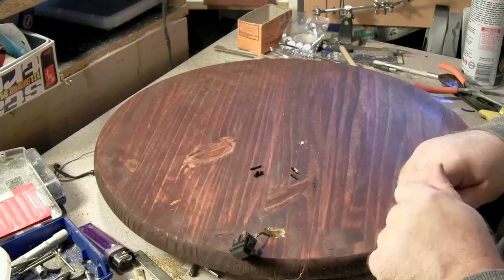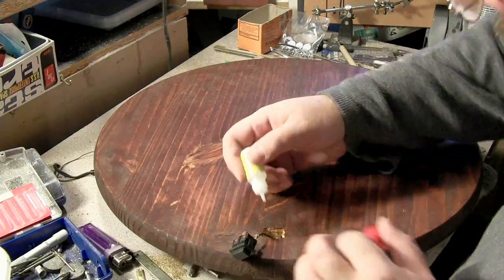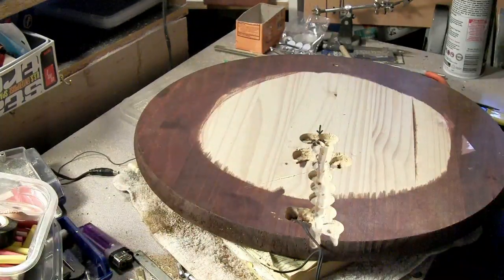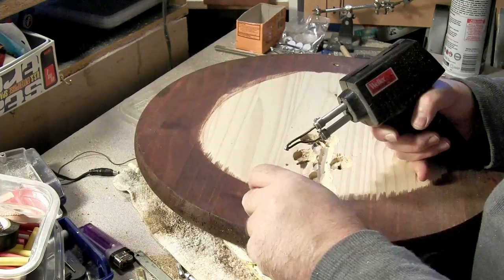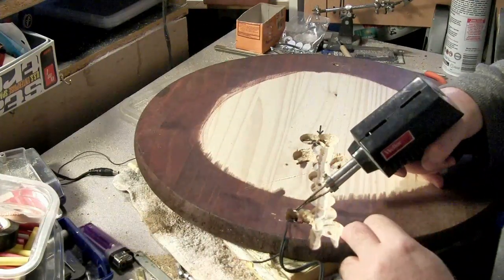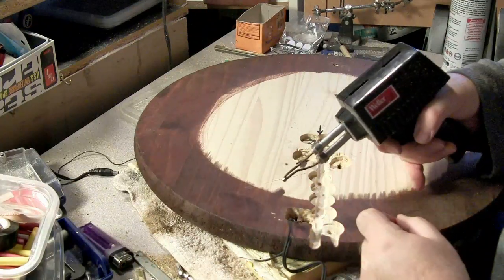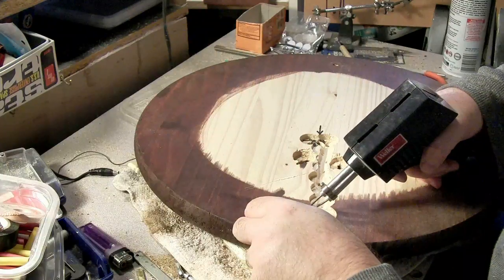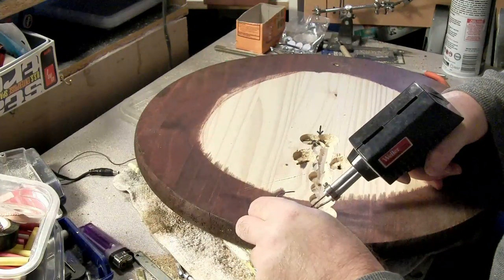The trick is going to be not gluing the switch mechanism. Don't be afraid to yank your connections, because that's the way to tell if your solder really set or not. The longer you got the tip on the solder, the more likely you are to get the solder on the tip here, and that's definitely a hindrance. Basically, what you want the solder to do is get wet enough that it soaks through any fringes and basically locks that in place.